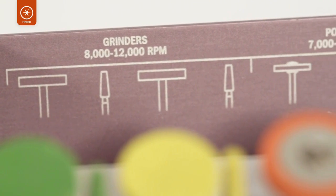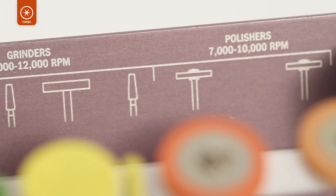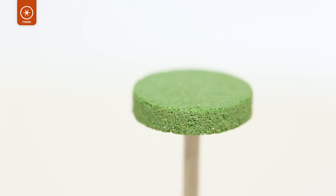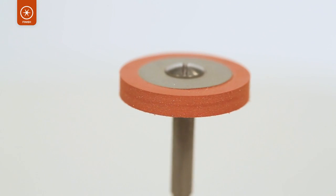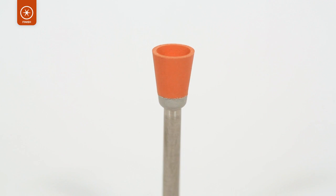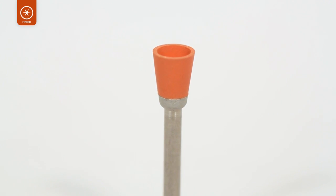When you're finishing and polishing, think in your early steps about greater spreading over a large surface area — using larger wheels, larger discs, larger cups — so that you're smoothing and blending before you think about polishing. Then, once that surface is smooth with a continuous contour without any ripples, you go to your high shine.